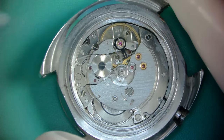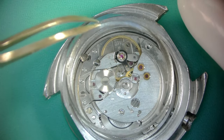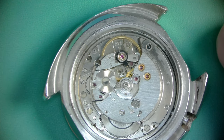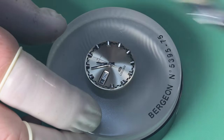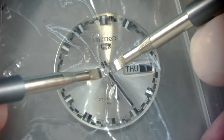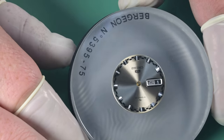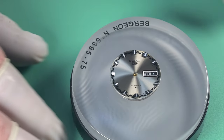I tried using Rodico to pull the case clamp out but ended up just pushing it deeper in. It moved out of the way though, so we can get the movement ring out. It's a little dirty but nothing terrible. Once the second case clamp is removed, we can get the watch out of the case — and this is what sold me. That dial is just unbelievable for its age, as good as anything they make today. This watch is from 1968 and that dial is just perfect — a really good value proposition on these old Seikos.